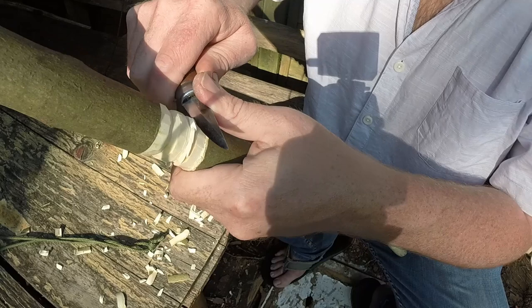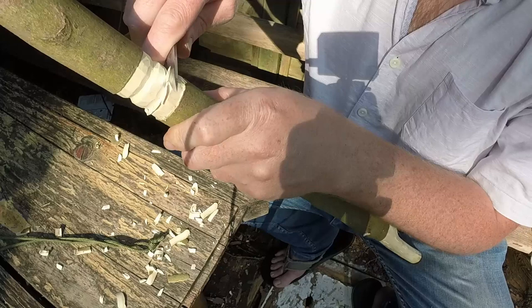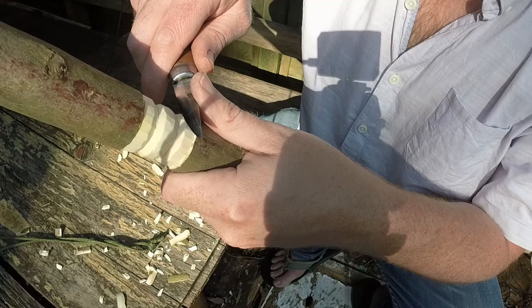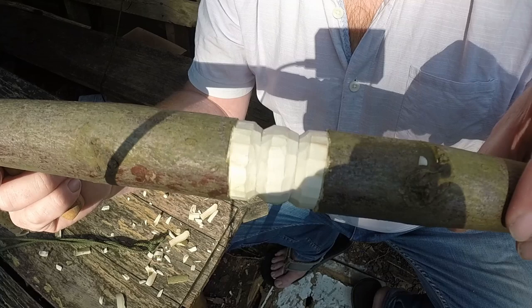See how the pieces aren't coming out here - they're kind of staying in there. So again, if they've not come away clean, I'm going to go around and just follow my stop cut line and break those fibres. And they have come away - they were just hanging on because the fibres hadn't been cut. So we've got a little loop around there.